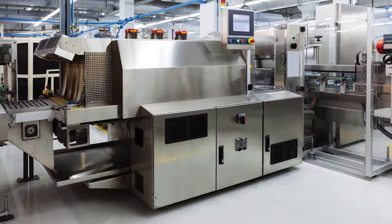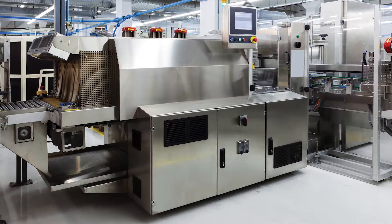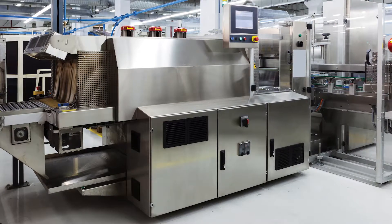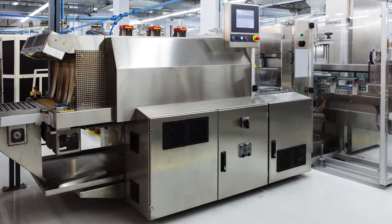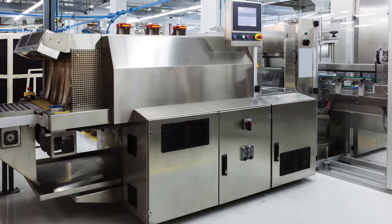Acme transformers should be specified to eliminate double wiring, operate 120 volt equipment from power circuits, insulate circuits and establish separately derived circuits, provide three wire secondary circuits, and provide electrostatic shielding for transient noise protection.